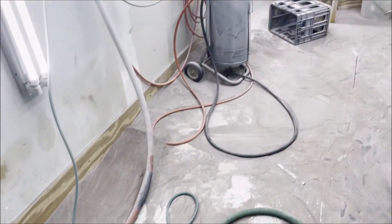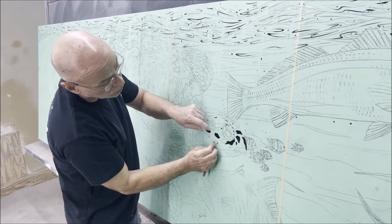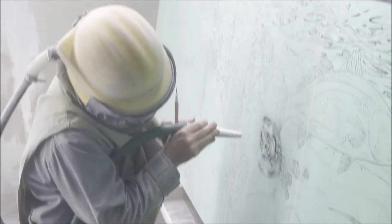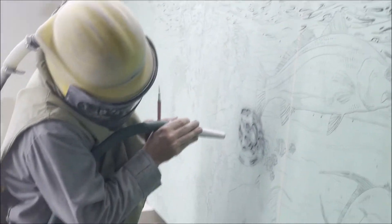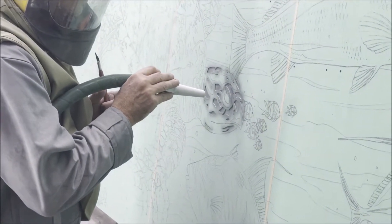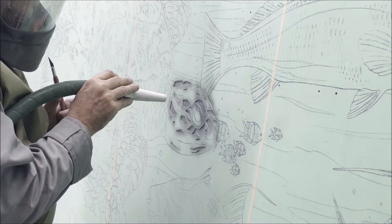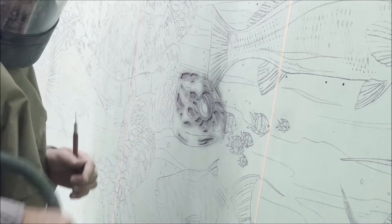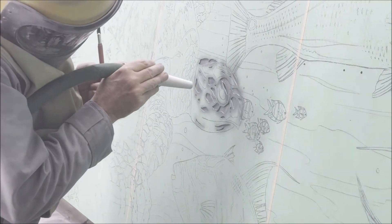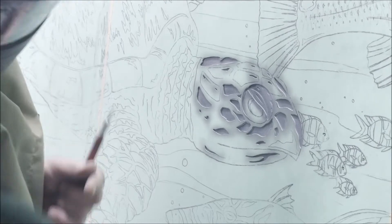What we're seeing right here is a very important part of the process. This is Richard in the sandblasting booth, sand carving our windows and clients' design work. Through sandblast equipment and compressor equipment, we are able to finish our creative etchings. What we use is a very fine powdery abrasive called aluminum oxide — this is what cuts into the glass with pressurized air. We fill two different hoppers — either a siphon feed or a pressure feed sandblaster.